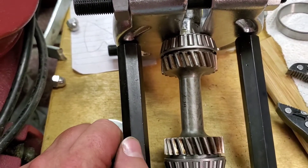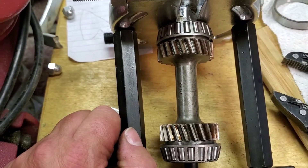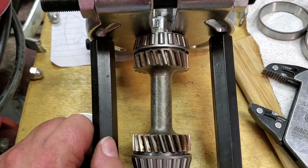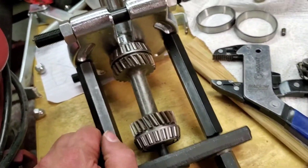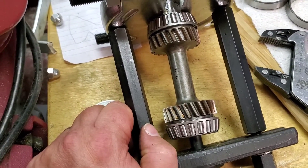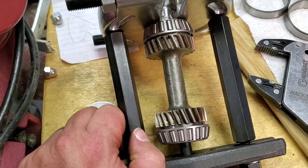So I used the bearing puller to put the bearings back together again too. I did try heating these to 250 degrees — I don't know if I'd recommend that. It didn't really seem to have too much of an effect on getting them on. But the bearing puller again — I'd choose that — squeeze it right together, and yeah, looks pretty good. So tonight I'm gonna go ahead and put it together, and hopefully that's it.